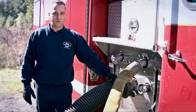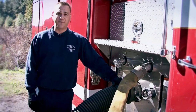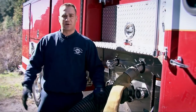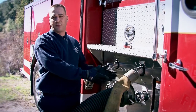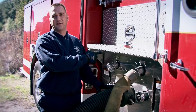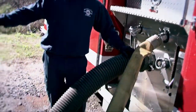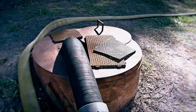On this side of the truck, this is going to be our intake side. We've got our 6-inch intake. We have 20 feet of intake hard suction into the pump, and basically what we have at our facility is an underground 13,000-gallon tank that has about a 14-inch pipe running from the tank to the other side of the apparatus under the ground into our pickup tank. We've got our strainer down in there, and that's where we're going to pick up our supply from.